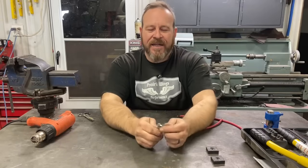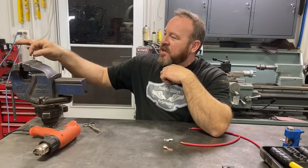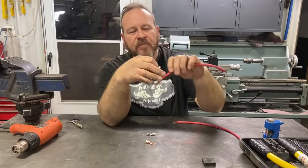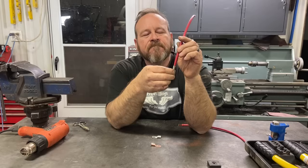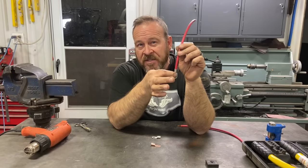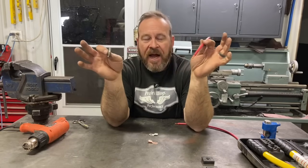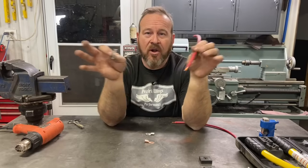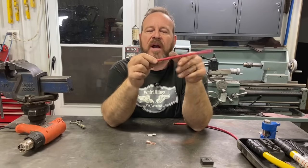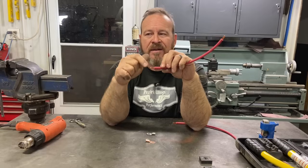Back in the day in the early 90s I was taught in technical training to take one of these cable crimp ends, crimp it in the very edge of the vise, heat it up with a propane torch and fill it with solder — not all the way — then dip the end in and keep heating until you see the solder suck up into the wire. I used that method for a lot of years and I thought it was great. But I did see some problems with solder where the wire is stiff for a long ways back, and in a high vibration environment you ended up having some strands of the wire starting to break away.